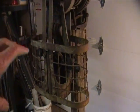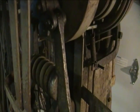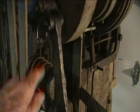It needs to go around, and since it's on pipes I put a board under here to make it easier. Notice the t-tump, t-tump — Sid says that sound is indicative of the machine needing a new spring. It also could be that the shims between the wraparound guide and the base need some of them removed to tighten up the ram. Sid always recommends that if the hammer hasn't been running in a long time, replace the spring. littlegianthammer.com has all those parts — I think it's about 50 to 60 bucks for a spring.